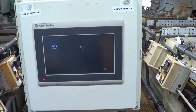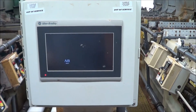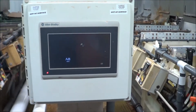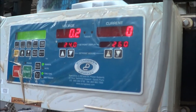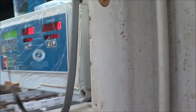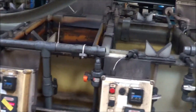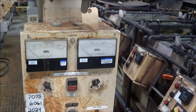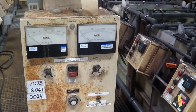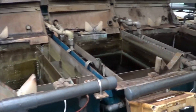There are three rectifiers that we will show you on the other side. There is a 2000 amp, 75 volt unit that does have a PLC control, built in 2016. There is also a DynaPower switch mode rectifier — a 1000 amp, 24 volt. And there is a 300 amp, 24 volt rectifier. The 1000 amp and 300 amp 24 volt units were being used for Type 2, and the 2000 amp 75 volt was being used for Type 3 anodizing.